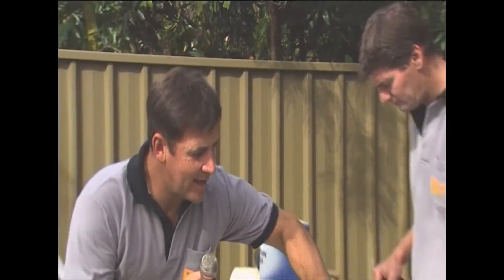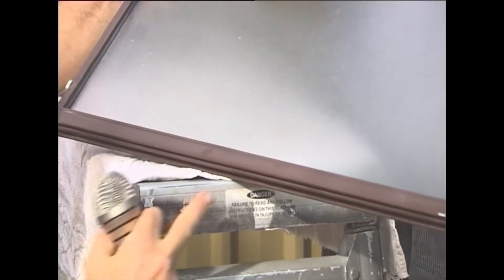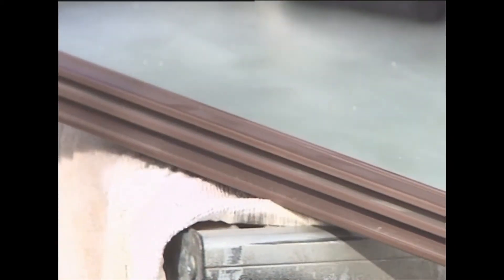It's around in the corners that's really important. If we focus in there — let's tilt it up a bit Pete — you can see there's lots of dust and build-up. He's got to get the scourer, turn it sideways, get it in there and get it clean. That's part of the spraying service, and it's one of the bits that can easily peel if it's not cleaned and prepped right.